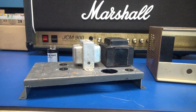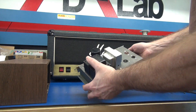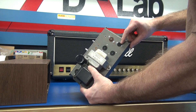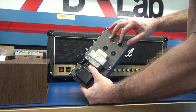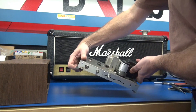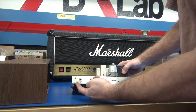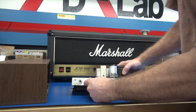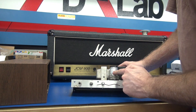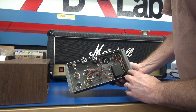Here's an update on the AO44 retrofit project. I've got my 12AX7 and 6AV6 sockets installed, and they're going to drive a pair of EL84s. I've also installed a new front aluminum panel with input, volume, and tone controls, and it has the power switch on it. Filter cap is installed, getting ready to wire the bottom side.